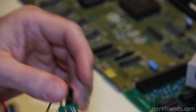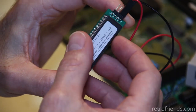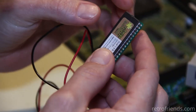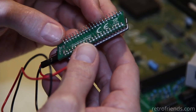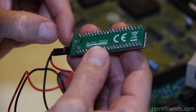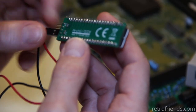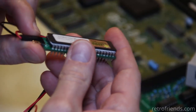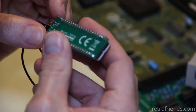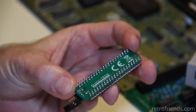I have another video about doing a DIY ROM switcher, and this one is definitely not quite the same because that's actually not pin one - pin one is up here. You just need to get some concept of how this is wired up. There is another connection to another pin over here: R1, R2, A18, and A19 - so that's referring to the address line.